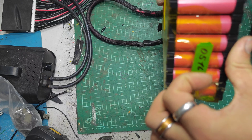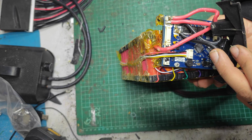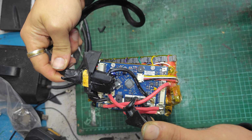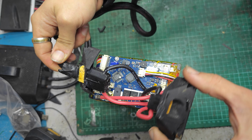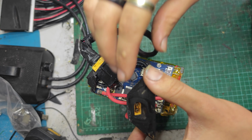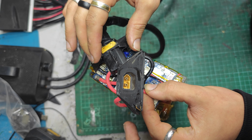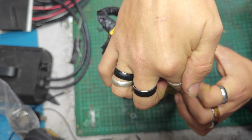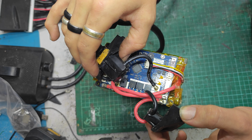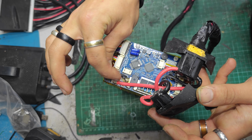Right, so this might be a smart type module because I'd imagine there's TX, RX, and power. The battery controller S516 version 2.1. This looks unsafe. Right. So, charge port. We've got charge port connected to C- on the board. Just there. We've got positive connectors to the main positive lead there. L plus, that says. And the other positive goes to here, which probably runs in the board somehow over to here, I'm sure. And then our negative out to the discharge goes to L minus. And our negative in from the battery comes from here, which is fine. That's B minus, that makes sense.